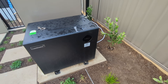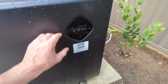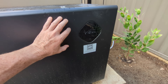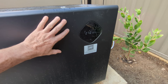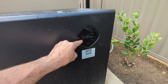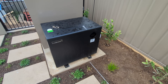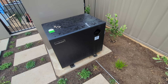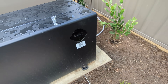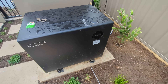So really there's this huge trade-off with these heat pump systems and the flow rate. Just be aware that it's not just this Madimac one — they're all going to be like this. All heat pumps will have an optimum water flow rate, and it's a fairly small window: 60 litres per minute, plus or minus 20%. That's not much. And a 2 to 3 degrees C differential. And if you're not within that, then you're just wasting the power going into this thing. So when I took this thing out of the box, I plugged it in and I was wondering why I was only getting half a degree or no temperature differential, even though it was at 100% maximum 11 kilowatts heat pump power.